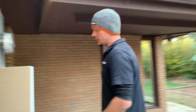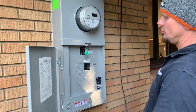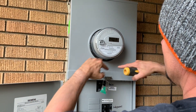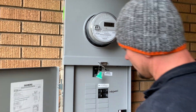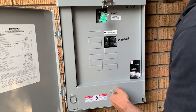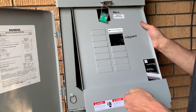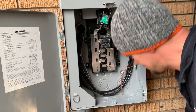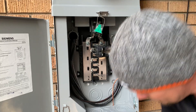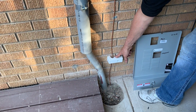When we got here, there was basically just a little meter — about a square cabinet inside of a round meter. A lot of you've seen my videos. We already know that we have to have an ISBB — inter-system bonding bridge bar. We have an eight-foot ground rod. They already had a direct bore here because years ago they had a conduit come up and they capped it.